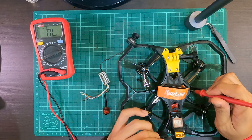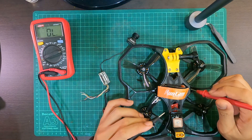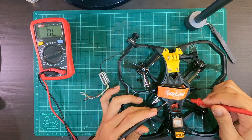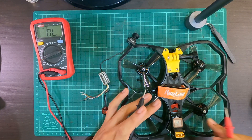Basically, these screws were touching the carbon fiber of my quadcopter, and this carbon fiber can actually conduct ground with no problems. For example, touch one screw over here and touch this screw on the back — that's basically grounded. So once this air unit was touching the carbon fiber, it started moving towards this screw and that screw, and there was continuity everywhere.